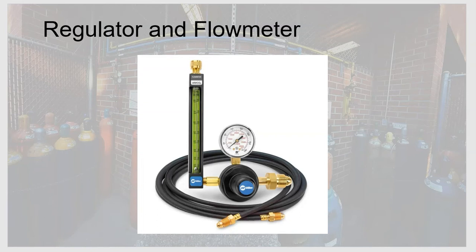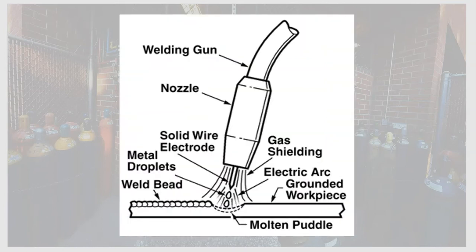When hooking the machine directly to the cylinder, it's a shorter route for the gas to travel, connecting into a regulator and flow meter. You still have a regulator and flow meter with a manifold system — there are just multiple throughout the shop. Looking at a diagram, we can see the neck of the welding gun, the nozzle, the wire electrode, the welding arc, the weld puddle, and droplets of filler metal. The shielding gas surrounds and covers the weld, keeping all impurities out.